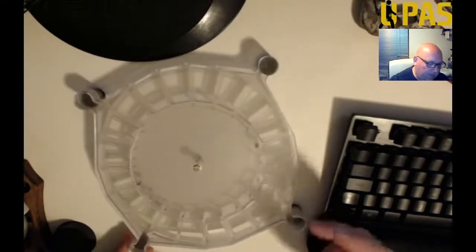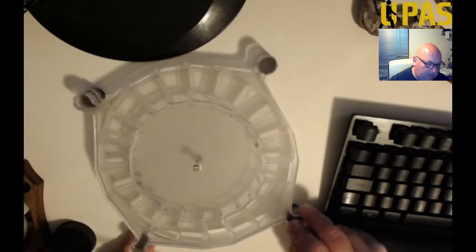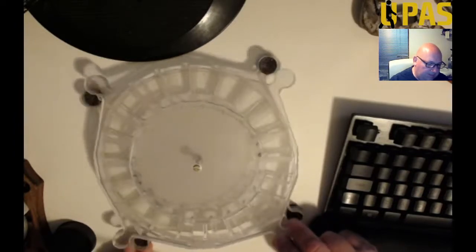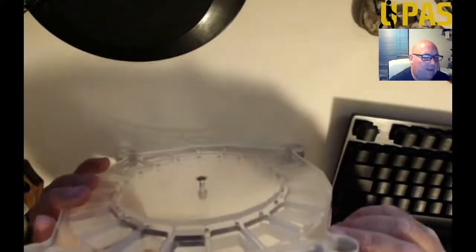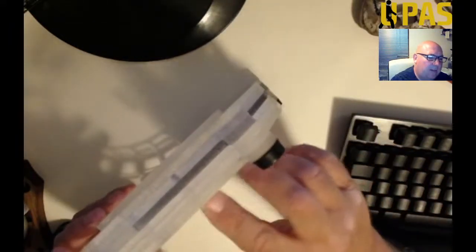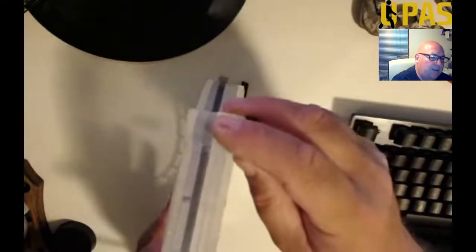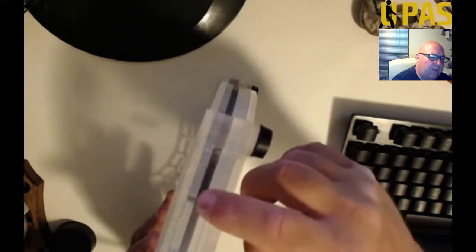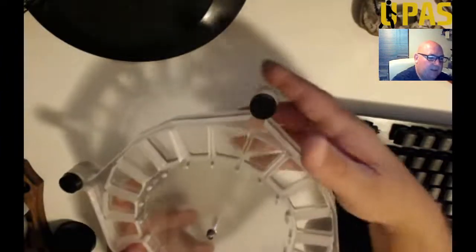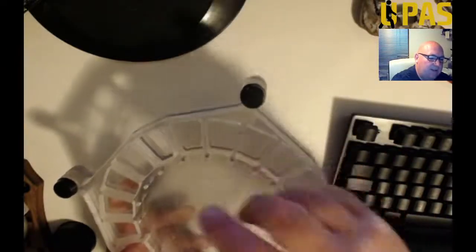So there's two ways to operate this. You can either hold all three. Well, I've got to tell you that I've plastic glued these first three. Treat these three as a layer, because one is the bottom of the pocket, and the other two are the height. I've got a dual height, so you've got 5mm, and 5mm with a cutout, another 5mm with a cutout, and that gives you 10mm pockets, and you've got a clean pocket. So, as you can see, straight through it. That's the better option, for me anyway.